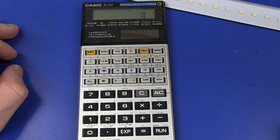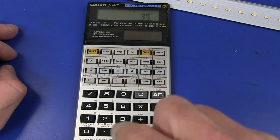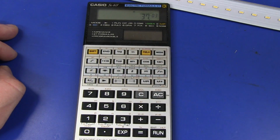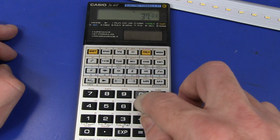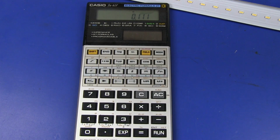And of course, if you do the math, it's very easy to explain why they can get away without direct bonding to the heatsink. It's because the individual LEDs don't dissipate much. I mean, it's 37 milliamps each. It's bugger all, basically, times a nominal 3 volts on there. Each LED is dissipating only, or consuming only 0.11 watts. I mean, it's bugger all, really.